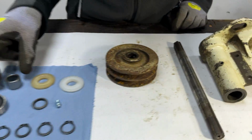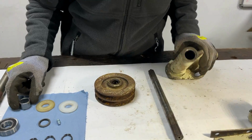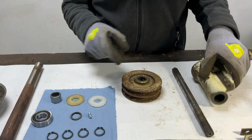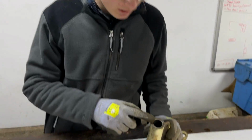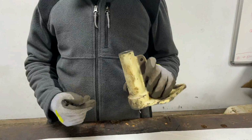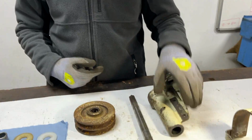And the first thing we're going to put on is this needle bearing, which needs to get pushed in there. And we have actually checked on the outside of the bearings that they are an interference fit with the PTO. Because obviously when the previous bearings disintegrated, the shaft would have been flying all over the place, and we wanted to make sure that that didn't oval the shaft too badly. And they are still an interference fit, so that is all good.